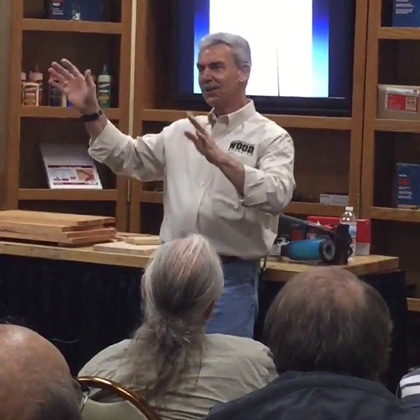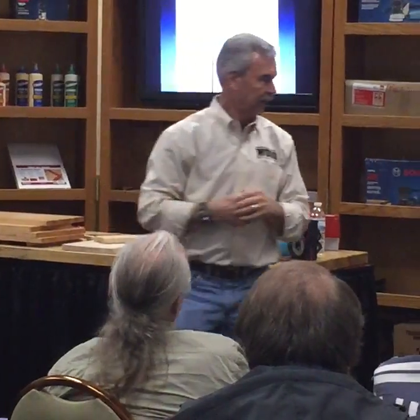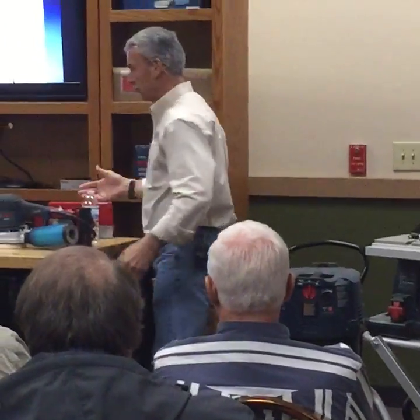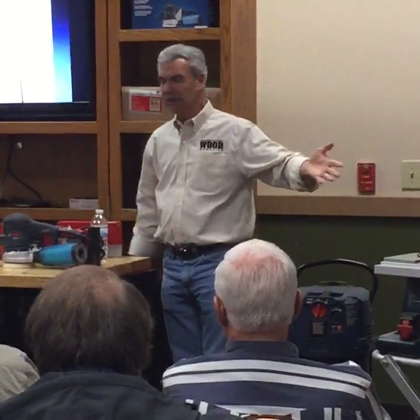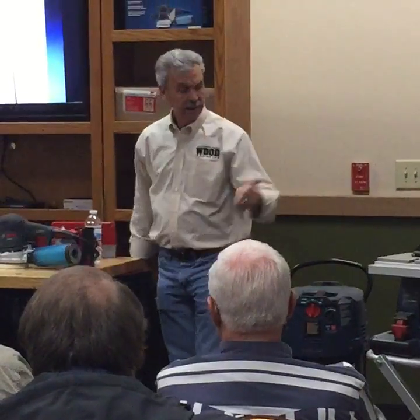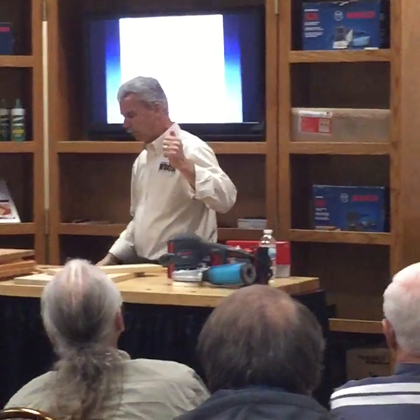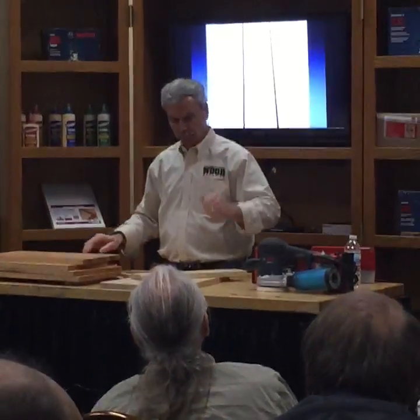90. Don't always work on what the symptom is, trying to fix that by knowing, well, at least it's 180, or it's a complementary angle, I know I can fix that. The fact is you can't. You're going to fight that the entire glue up, and that's what causes a lot of your problems, okay? So just make sure that it's back at 90 again. I do it every time. I don't take mine off of 90 as often, maybe, but when it does go back up, I make sure I check.